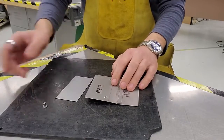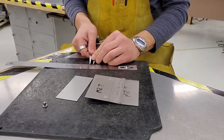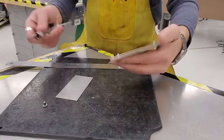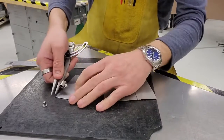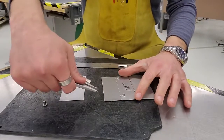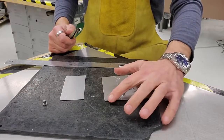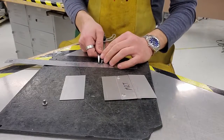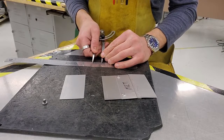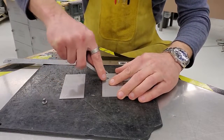We're going to do this very similar to how we did the pop rivets — we'll start with the same measurement but only along the long side. We're going to set these two again one-fourth of an inch, scratch the line there. Last time we did it half an inch; this time it's different — not half an inch from the edge. We're going to go one full inch, so I'm going to set my dividers to one full inch and scratch these lines.